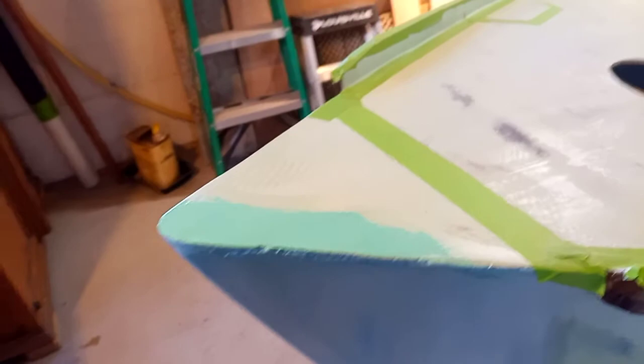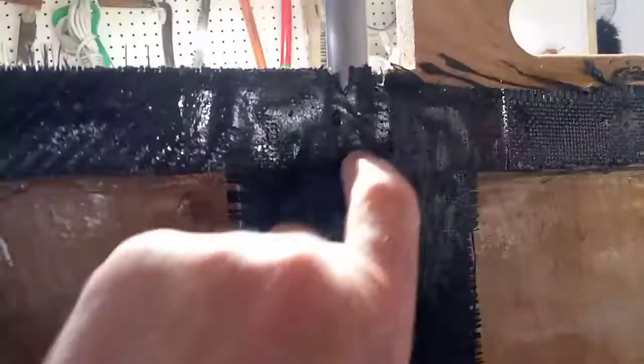The other thing is the rudder — I basically covered it with thickened epoxy with a whole lot of graphite powder in it. You can see it rotates nicely on the shaft.